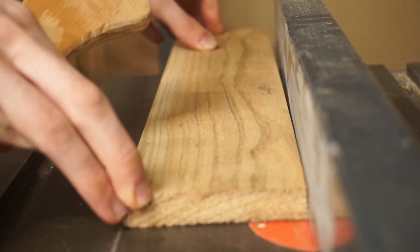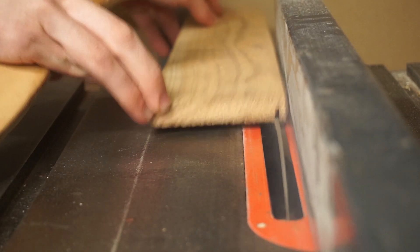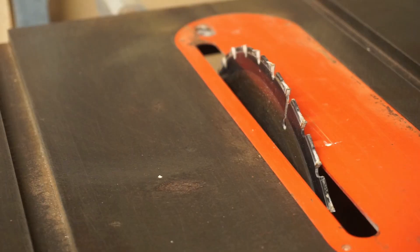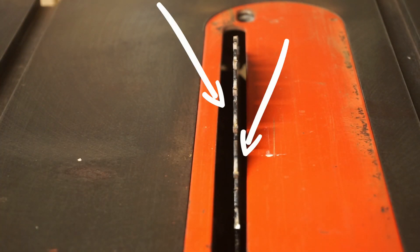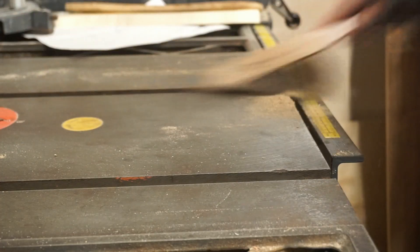Let me step back for a moment. Here's the end of each of my boards. I need to somehow remove material at each end so that the siding board's profile looks something like this. Then I can stack these shapes together to form a solid, continuous surface that will cover my house. Normally, on a full-size board, ripping a profile like this would be a piece of cake. But on a board as small as these siding blanks, I run a serious risk of the saw pulling the board down inside it, and I'm having trouble figuring out how I'd safely hold material this small anyway.